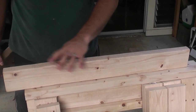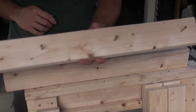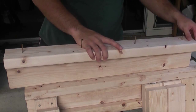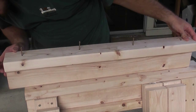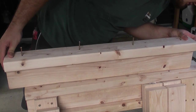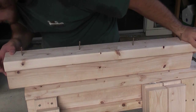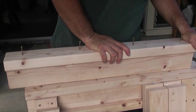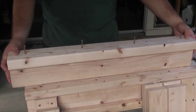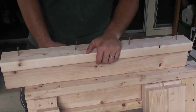What we're going to do is take the central portion. We have the top here, but I haven't put the screws in yet. This is going to be the bottom — you're going to put this one on first. And then this is the central piece. What you want to do is line up both ends until they're centered as best as you can. You can measure this or just eyeball it. Once you've got it centered, push the board down so that the screws seat, and then drive the screws through this board and into the center portion.